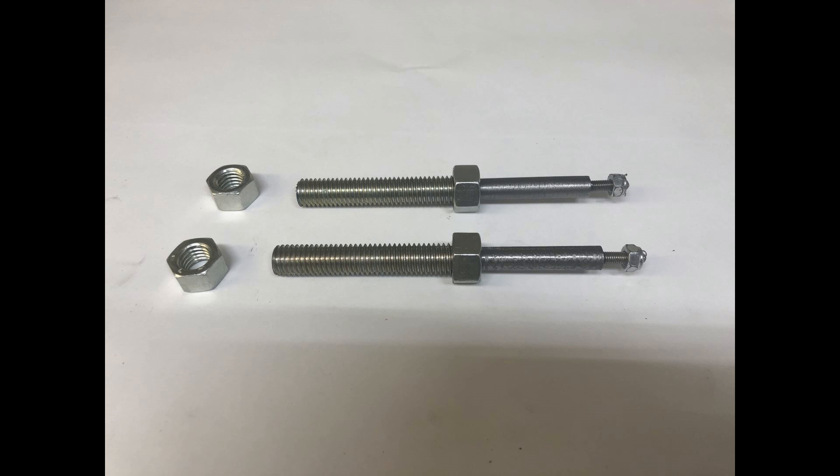When you think about the axles, I used 3/8-inch all-thread and got my lathe and machined it down so that the wheels could slide on. The wheels do have their own bearings, so they're not just rotating on that shaft. They actually press on a little bit — not too tight.